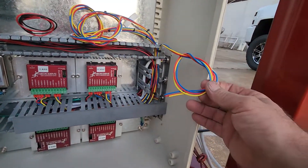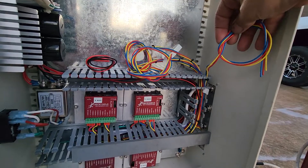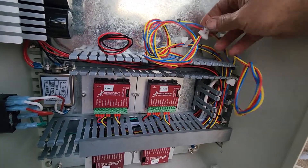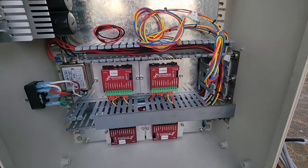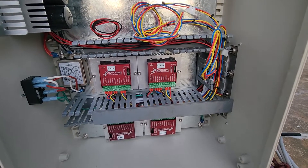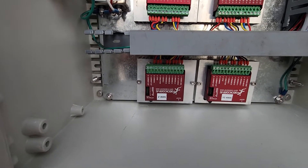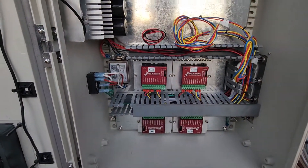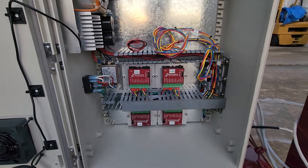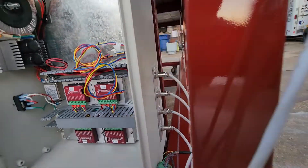All of the steppers are wired — these up here on the top are my inputs, all labeled XY. Three of these are NEMA 34 with 72 volt, and one — the Z-axis — is going to be 48 volt, 520 ounce. I don't see putting a 34 frame motor on a Z-axis; I'm not machining anything, this is a plasma table.